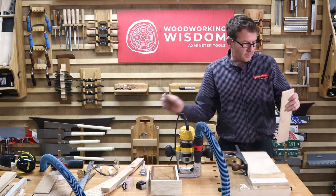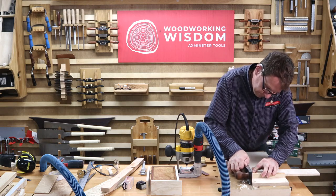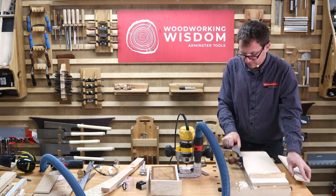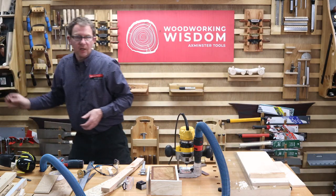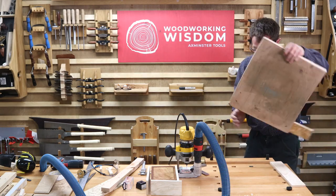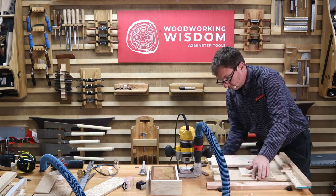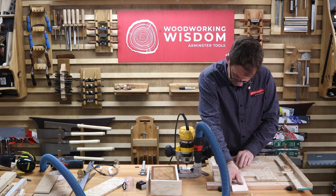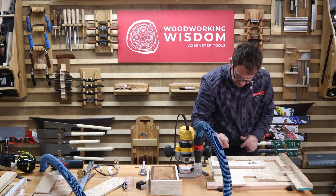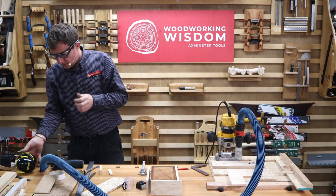Few things, so we know I'm past the saw cut now. We're square. See what's going on there, that looks good. So just put the plane back on the wall, swap things over slightly. Bring that up just to pinch it in place. Clean out the dust. More likely to get dust in here at the moment because we've got one side open, nothing blocking that void. We wound the fine adjuster down a little bit. So let's have another go, see what happens.